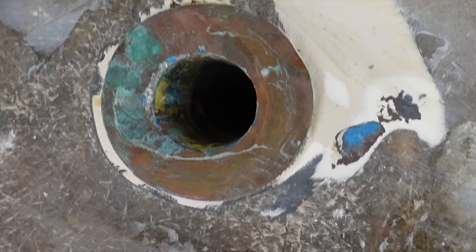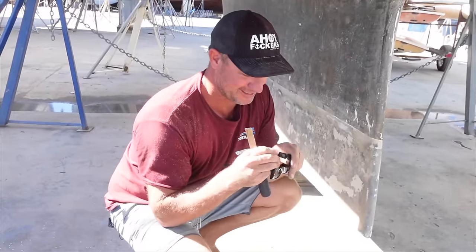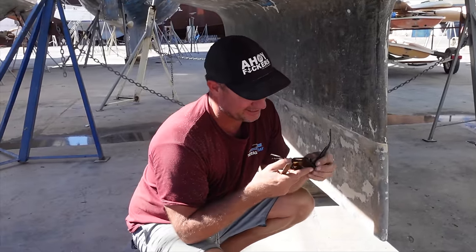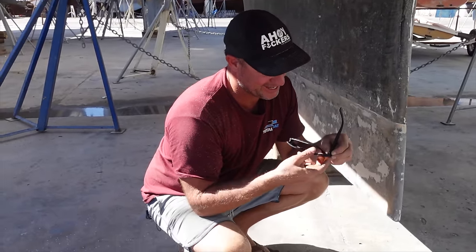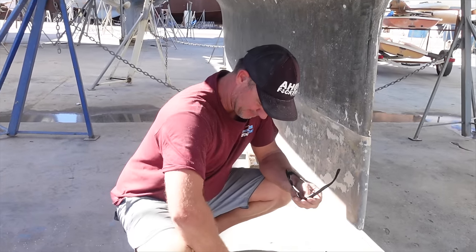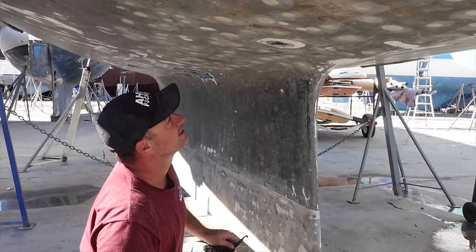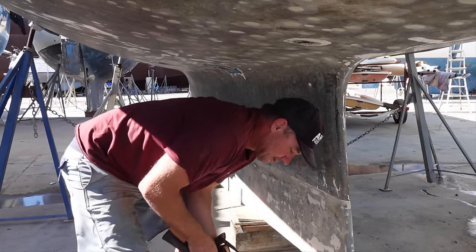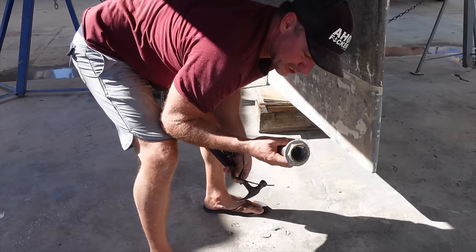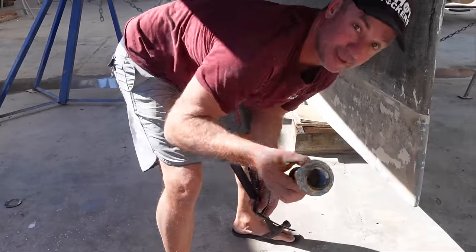There's one more under here — it's only got one lug. Some things you just can't fix. It's a bit pink looking so there may have been some electrolysis. The sealant's so old you can see it's really let go everywhere — so it's probably a good time to do them. There's a bit of a void in that one — the sealant wasn't packed in properly. The lugs break because they're old and brittle, but there's a lot of pressure on there too. I'll have to die grind that one out. It's an odd looking fitting — I've actually never even seen one like this.